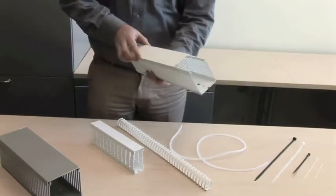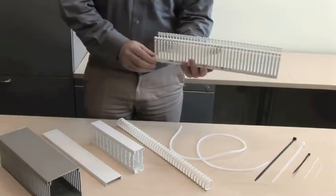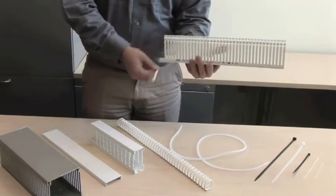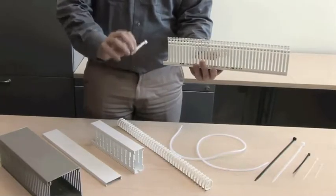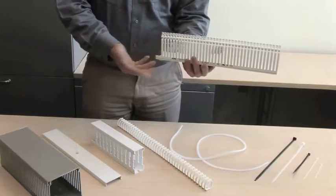The wire duct teeth have undergone a special embossing process that eliminates sharp edges, thereby protecting the cable and preventing abrasions from occurring to the installer's hands. The score line at the base of each finger enables a clean break to create an opening to run the cables through.